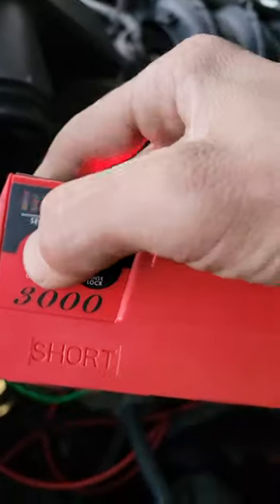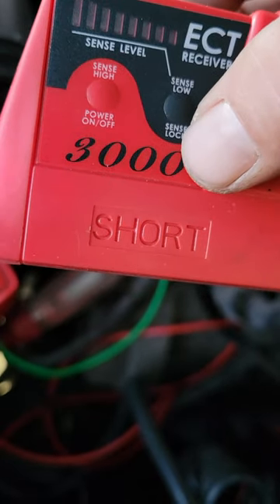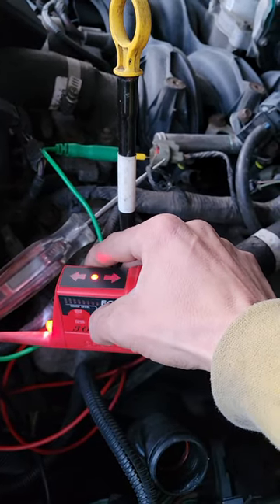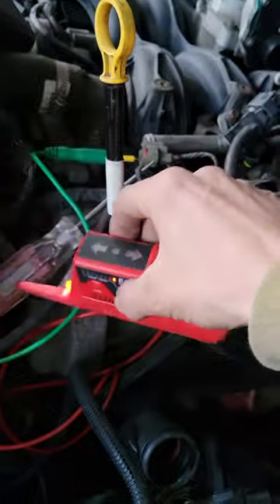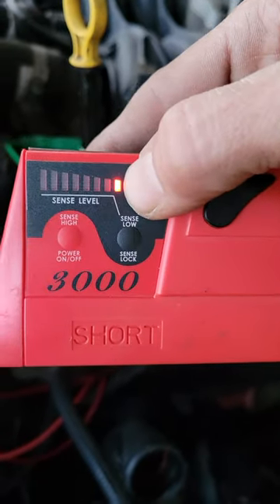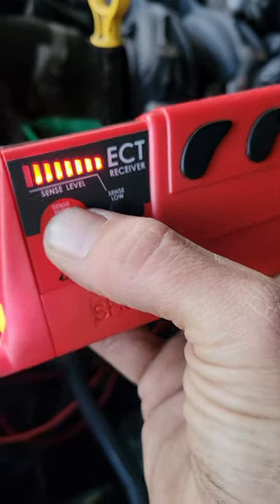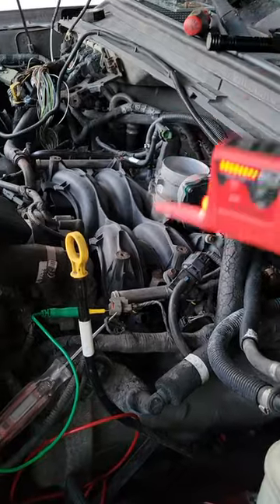Turn this on. That's high sense on and off. Low sense, sense lock — that's important to know. You're going to take the device, put it up to the green wire, let it get its fastest ping, and hit that button one time. This is sense lock — that locks the signal. Now we're not going to pick up anything else but this signal. Each one of these lights represents one inch, so right now we're at one inch. We're going to extend this all the way out to eight inches — that'll get us a signal off when we're within eight inches.